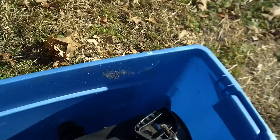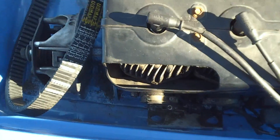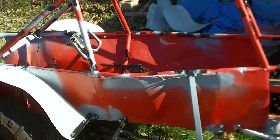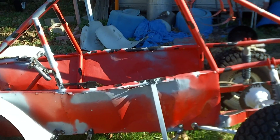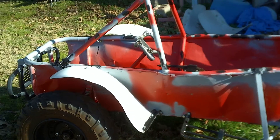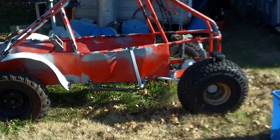There's an oil injector down at the bottom of the motor and I will be removing that. I had a nice scooter once where I'd hopped up the motor — ported the transfer slots, shaved the head, bumped compression — and it would smoke the tires. But the oil injector went out and the motor locked up, so I'm not trusting it on this build.